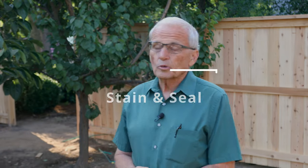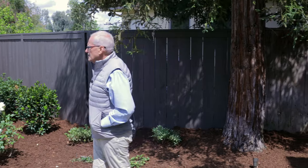The owners are still deciding what finish they want. If you don't use any kind of sealer, stain, or paint, it keeps changing color and eventually looks kind of dreary — though some people like that look. An important point: make sure you don't throw water on the fence with sprinklers. In this case it's going to be a completely drip system, so no irrigation water will hit the fence. That way it'll weather evenly without ugly discoloration where water hits.